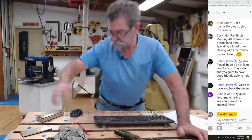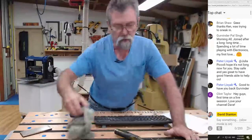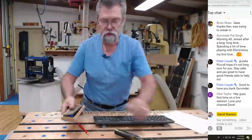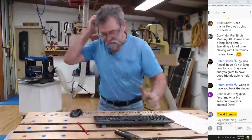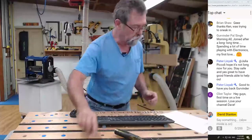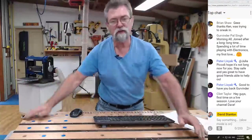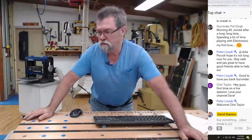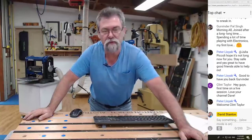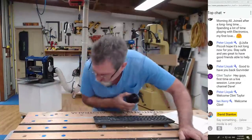Oh dear. That little gouge holder is in the deluxe kit, I think. If you get a Pro Edge, as I say, get the deluxe kit. It's designed for wood turners, but that little gouge holder is also very good for sharpening drills. Obviously, you need practice. It's not going to just do drills without you having any control. You might stuff them up, but use an old few and you'll be right. Here we go.